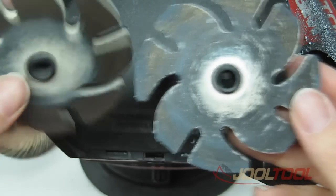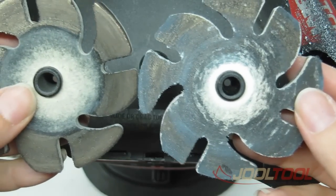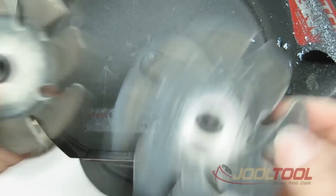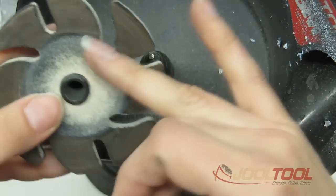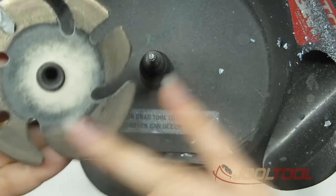The advantage of having the ninja disc backing on your felt is you never encounter groove lines and never have to treat your wheel again. This is the only time you need to treat the felt wheel — after that, it will always maintain a true and flat surface, just as you see on my felt wheel.